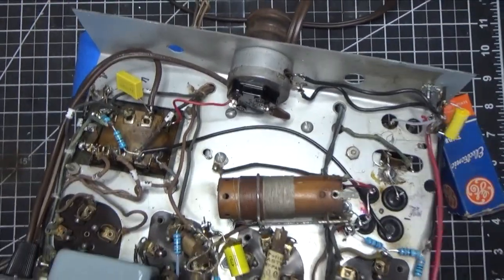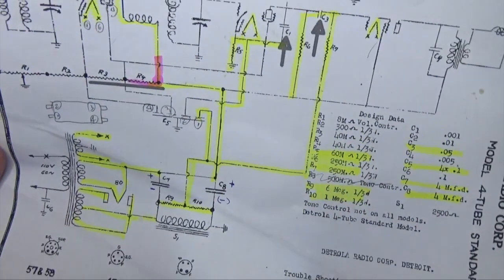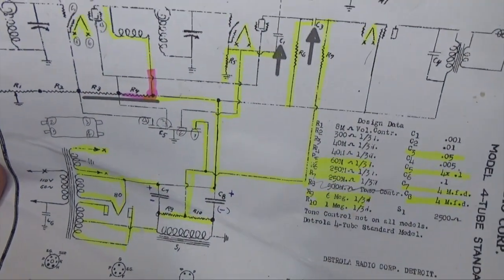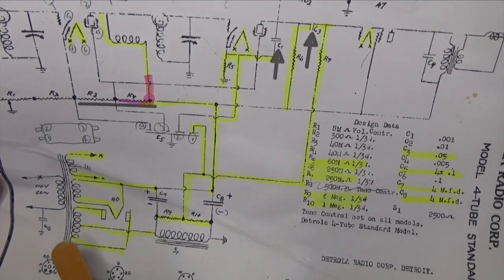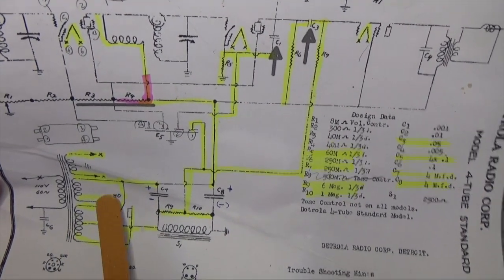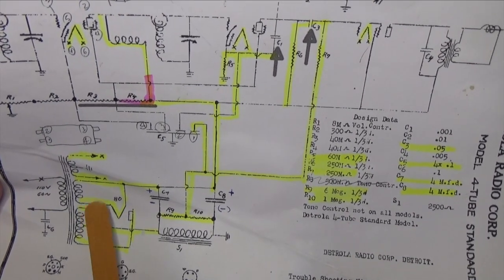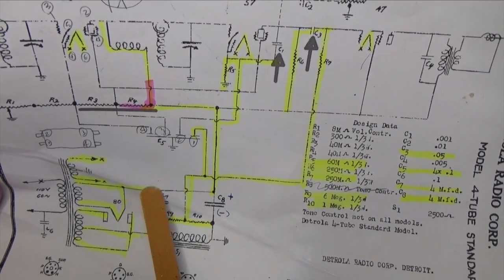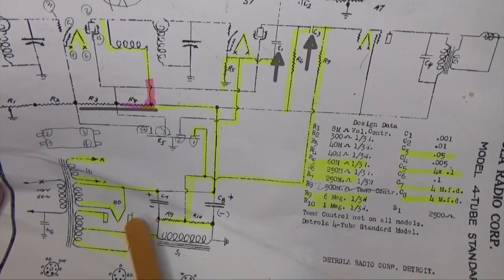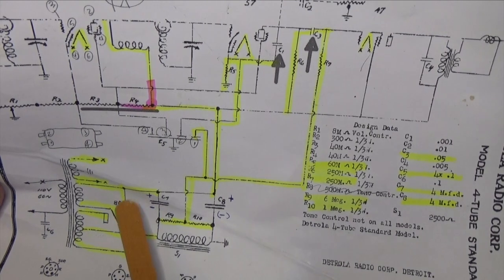And the only thing that really threw me for a loop on this radio, and it probably shouldn't have, and I did have to reach out to Brendan just to confirm. You'll see here, this is the 80 tube, the rectifier tube. Here are the plates. Here's the filament line. Well, the filament line actually is B plus. If you follow this, it's B plus for the radio. And I was like, how can the B plus be on the filament line? That didn't make any sense to me,